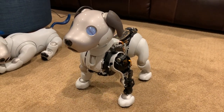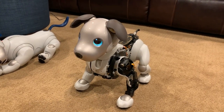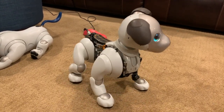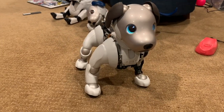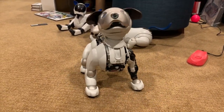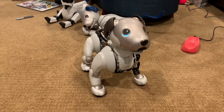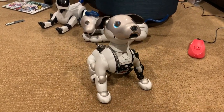Especially since that last hip plastic was so shredded I wasn't totally sure I got the new one in the exact same location as the other, because they're not keyed. The encoder for those is actually deep inside the gearbox, so your only way to know for sure that it's going back correctly is to mark off the old one at its home position — but that wasn't really doable since it was missing so many gear teeth. I kind of just had to guess, and it looks like I got it right.